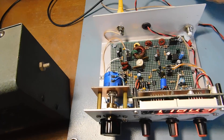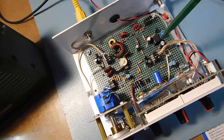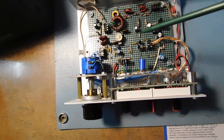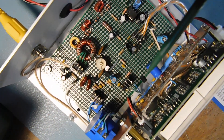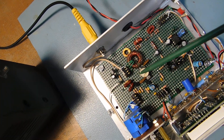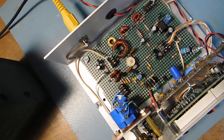Here's how I put it together. I made it so that with some connectors I could remove this circuit board if necessary by just unplugging this stuff. These are kind of crude header connectors, actually cut down from a single one — just whatever I had in my junk box. There's the circuit and the digital dial. There's the buffer amplifier for the dial, the dial reduction tuning pot. Over here is the actual bridge section with the new inductor and a very high quality variable capacitor.